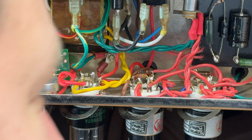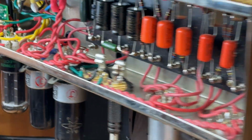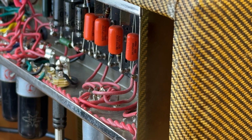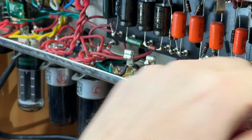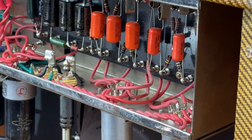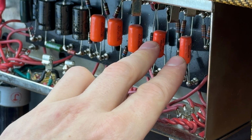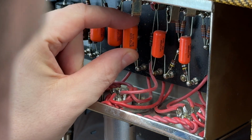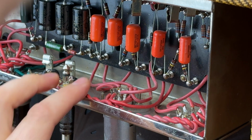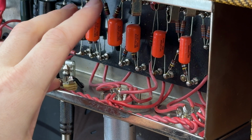So that's that. I'll just have a look, because I've just realised that these 2 coupling caps here, normally they're hundreds, and he's got 10 nanofarads in. Make sure you can see, these 2 here are usually 100 nanofarad each. The coupling cap to the phase inverter is usually a 22, and he's got a 22 in there. And the 2 output coupling caps are both 22s as well, and usually they're 100.